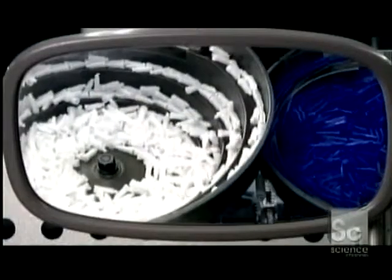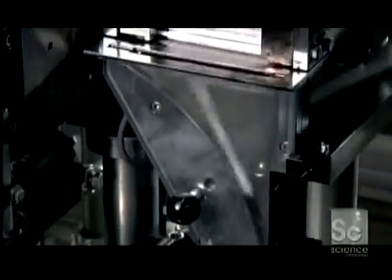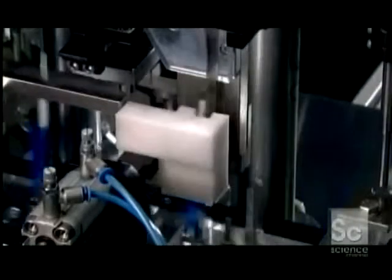First, the pen's 2-part push-button mechanism. Part 1, the plastic push button. Part 2, a device called a rotor. With each click, it rotates the refill 45 degrees, so the tip wears evenly. The ink cartridge goes in tip side up, the plug on the back fitting into the rotor.